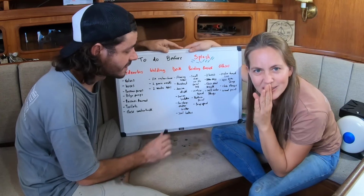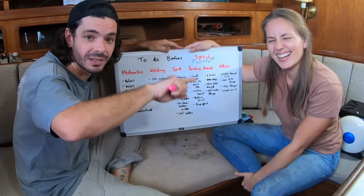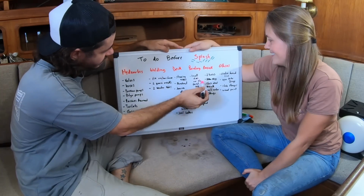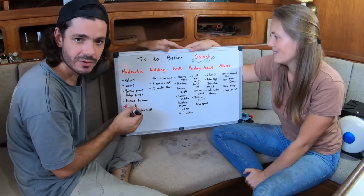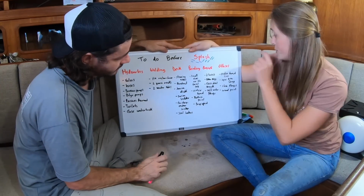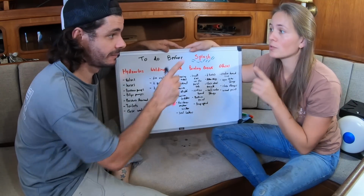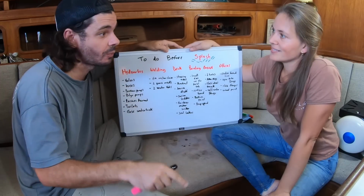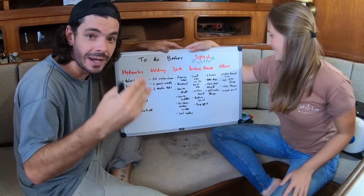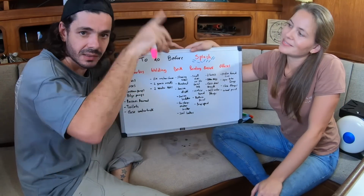This one is not that. Salt water flange. Yeah, there's the big flange with a valve that brings water from the ocean to the engine. Basically this is with the hydraulics, it's the same kind of flange. We are working all together. Others: the centerboard line we need to exchange, we bought it already to replace it. But more than that, we need to raise the boat, otherwise we cannot replace the line. So we are waiting until we raise the boat to paint the inside, and then we replace the lines.